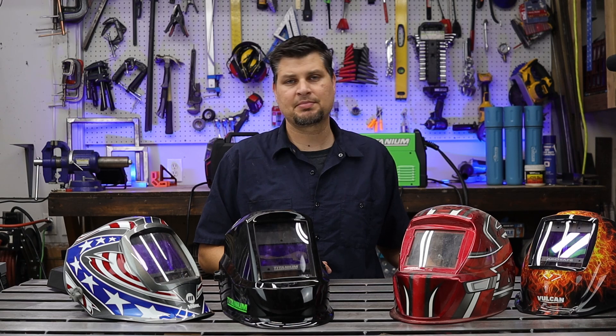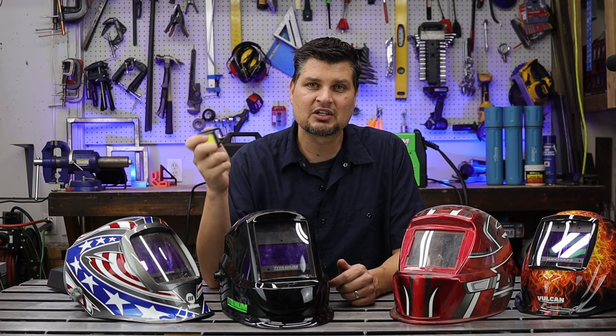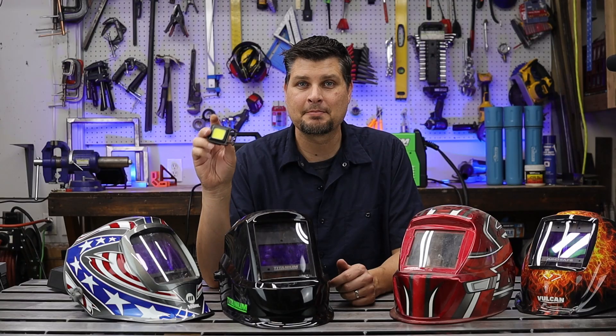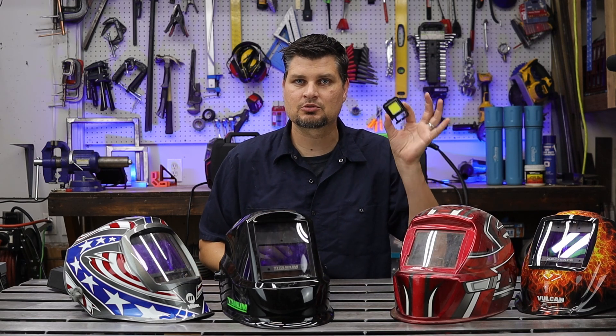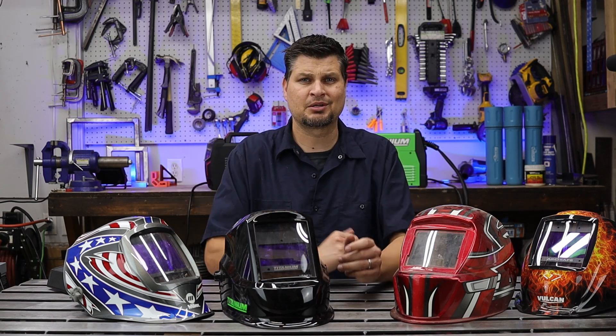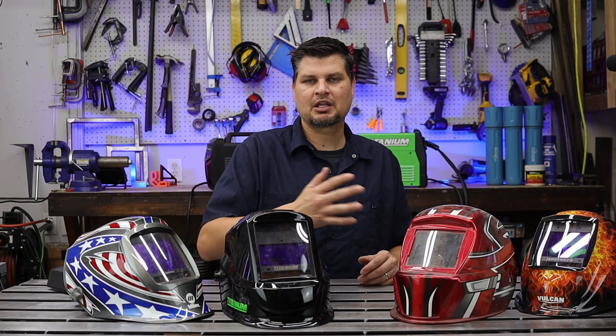Let's say you're all set up, you've got the helmet and everything, and it's still really hard to get in there and focus on that puddle as you're moving along. Here's probably the second best tip I can give you. My buddy Jesse gave me a bunch of these little LED lights that are super bright and it's amazing how well these work. You either attach these to the helmet or just put it right behind you somewhere. I'll put a link to them — Amazon probably has 5,000 to choose from. Pick up a light and an auto-darkening helmet and you're set.